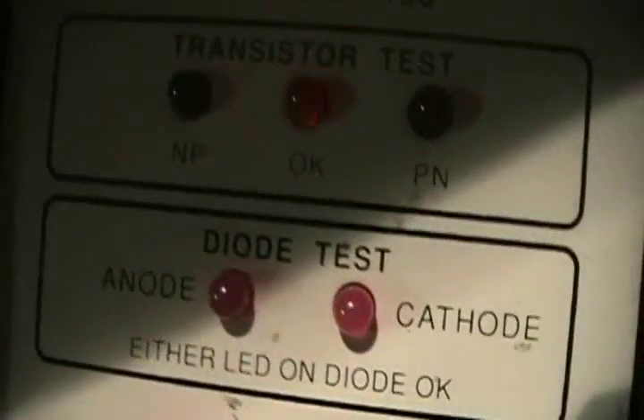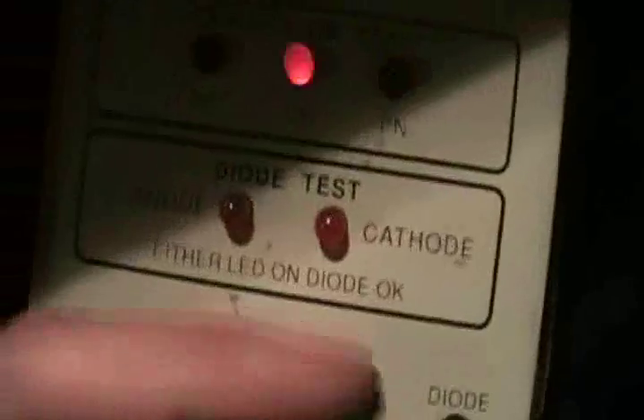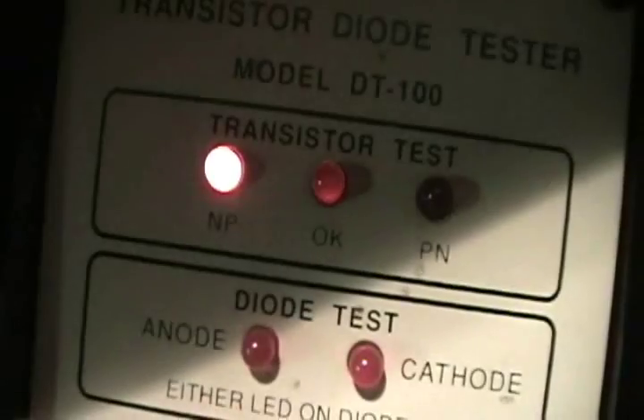Set this to transistor. Now you're trying to measure it — you have it set to PNP and you're wondering if it's okay. When the okay light does that, that means there's nothing on there. You're turning your base current up but nothing goes on. Keep testing, and you find that it goes to NPN when it's down low.